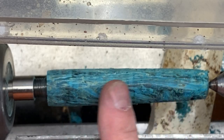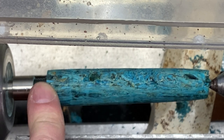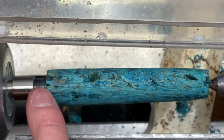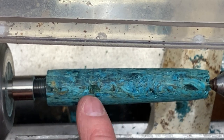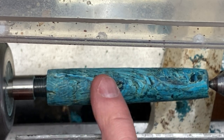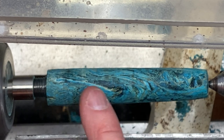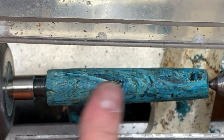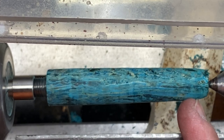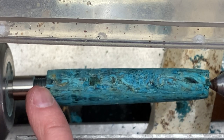I've been turning on this body blank for just a little while and it's been giving me quite a challenge. I didn't remember until I got the blank on the lathe that it had a nice big chunk missing, so I've turned down pretty far — I'm just under 19 millimeters. There's a chunk there where a leaf came out, and here's another example — the end of a leaf or a stalk. I keep turning from the headstock to the tailstock trying to cut that off, but it just keeps fraying up because that piece is deep and coming to the surface. So I'm going to try to sand that away, and we're going to have to cut part of the end off anyway since the blank is longer than we need.